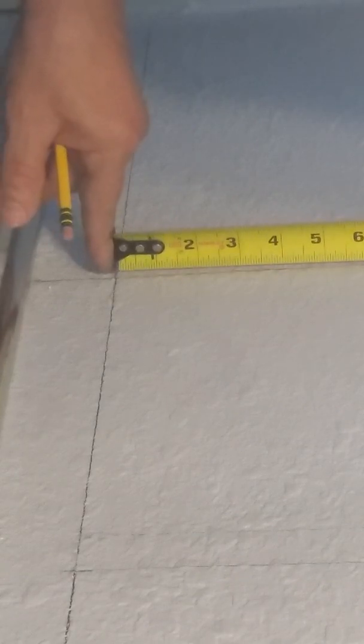Now, I know that the pivot bar, all right, the bracket, okay, is right here. This is the center, and that's at 13, okay? So I measure up off my bottom line because I'm coming up 2 inches. That's the bottom line, is 2 inches up. All right, I bring this down, line up this hook with the bottom line. Come up here, mark it at 13. Bam, dead center. All right, you're going to just kind of make a line or a crow's foot, which is a little arrow. Okay. Then you take your level again.